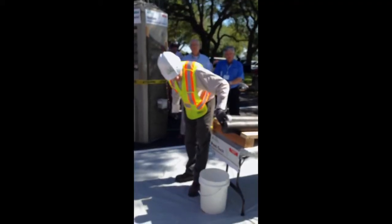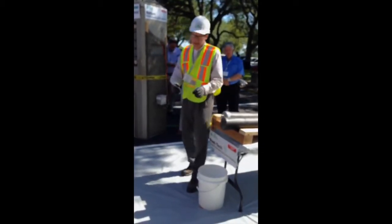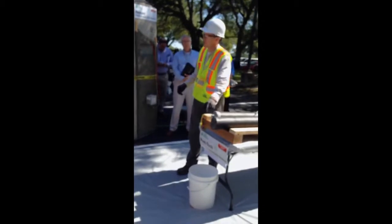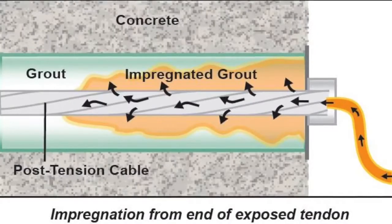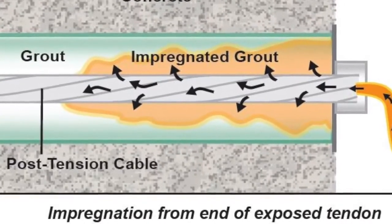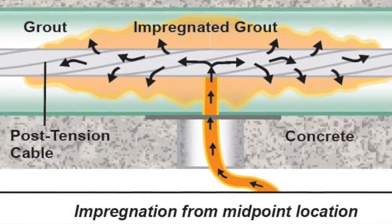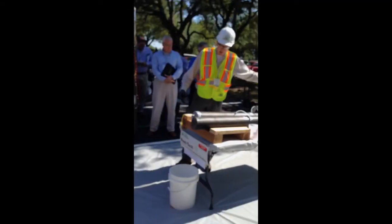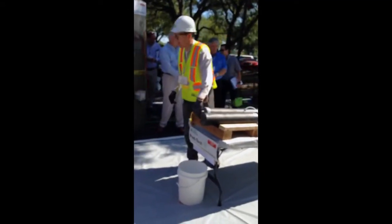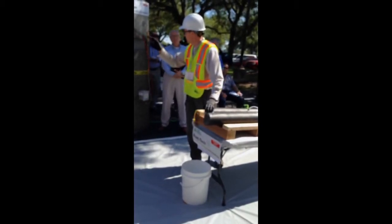You can come and take a look up here. You have a little pinhole, kind of a gap between each of the wires. We're using that as a longitudinal capillary along the length of the duct, and we're introducing material either into the end of the tendon or from a central location. For the demonstration, we're going to do it from the end and push it along those interstitial spaces and out the other end of the duct through that little pinhole.